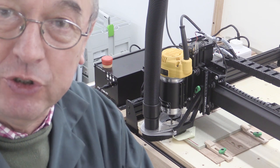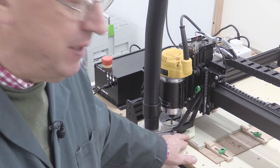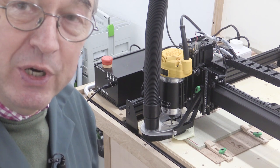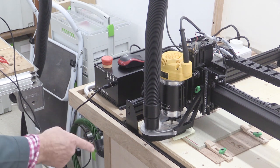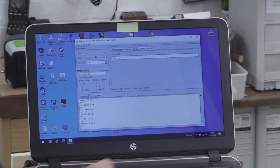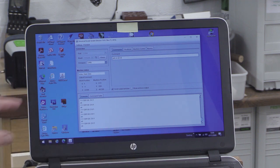But Z is a different matter because every time you change a tool it might not be in exactly the same place. So for Z I use a little piece of paper — in this case a post-it note — which I wiggle underneath the tip of the cutter, and when I feel it's just touching the surface of the material that's when I know I'm in the home position on top of that material. And that's it, just there — I've got it so I can just slide that post-it note out.